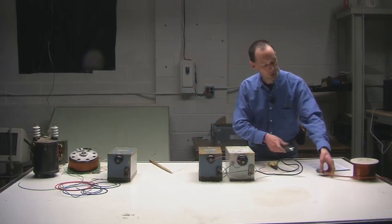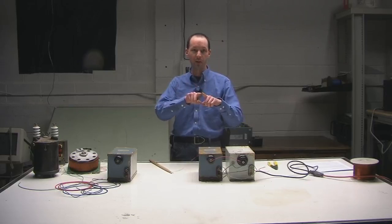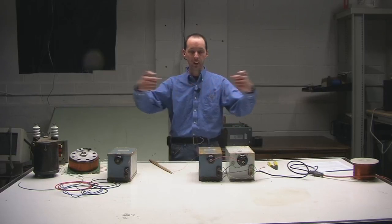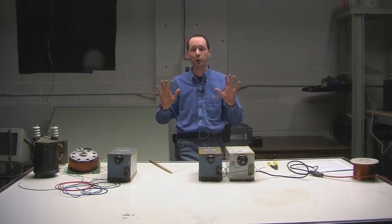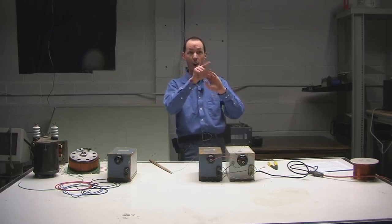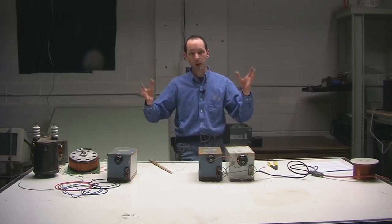can see the difference. But let's talk a little bit about volts and amps. Now, this is hot right now. Volts are what make the spark jump farther when it first starts. So to get two things to arc at 20,000 volts, they've got to be this far apart. But at 50,000 volts, you can bring them in, and boom, they go about here. So that's voltage. Voltage is the push. Voltage is potential difference. Now, amperage is the oomph. If you think of it like water in a pipe, voltage is the pressure, so how far the hose will shoot. Amperage is the current. It's the volume. It's how much water is moving through the hose in a given amount of time.